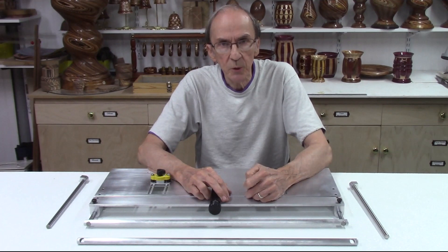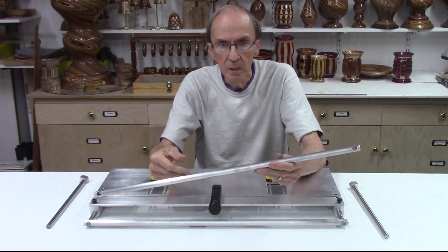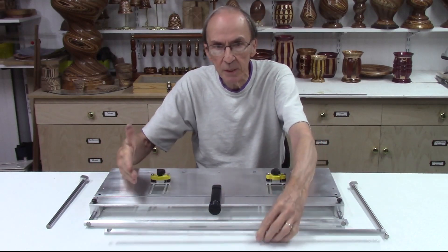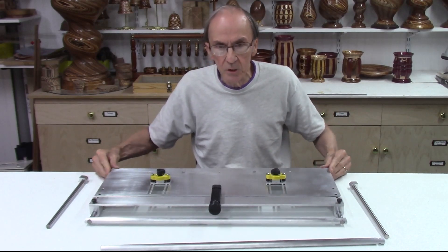Hello, I'm John Moneer from AccuSlice. In the process of assembling some of our AccuSlice systems, I needed some additional rear support bars. This rear support bar is attached to the two guide bars, one on each end of the index table, and they maintain the spacing of the two guide bars so that the index table slides smoothly back and forth on the system.